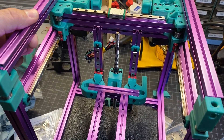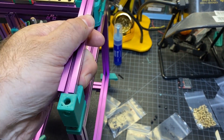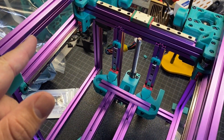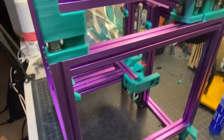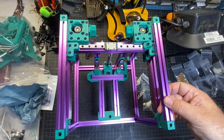At this point in the build I'm going to be adding the final two extrusions, which are B extrusions going on the side. I've got them just loosely fitting in. Before we do that, we're going to need to put in three nuts on the outside and two on the inside of both extrusions - so I'm going to go ahead and preload them. I've got two preloaded on both the insides and three preloaded on the outsides. Now after preloading, I'm going to put in some M3 10s into all four corners of the extrusion to lock things up, and then we'll be ready for the belts.